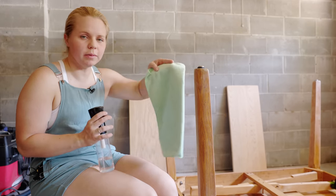I've kind of said in the past that I like to work in sections, but then I remember that I really don't like to work in sections because in the overlap areas, it can get dark and it will just be super uneven. So basically I'm gonna cover the entire table, trying to work pretty quickly so that it doesn't dry in certain areas. But I can use my Mr. Bottle to help me keep things wet. I'm just using a chip brush to spread out my gel stain.